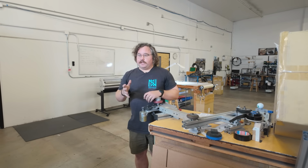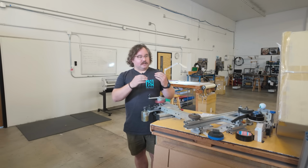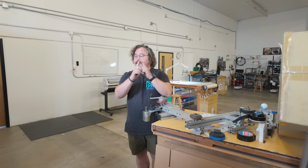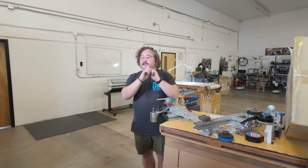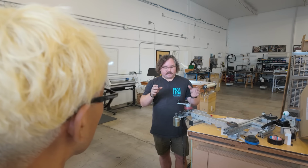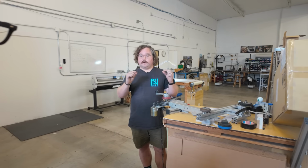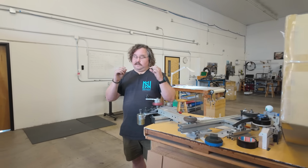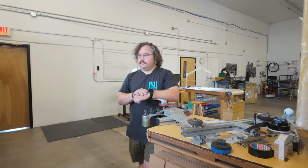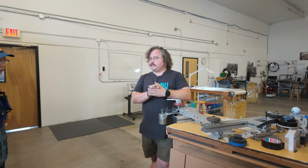Since we started as Rolf only, the paired spoke design, we wanted to make sure that the spokes would never pull through because there's a lot of force going to the same spot on the rim. So we have a thicker spoke bed that makes it so that you have a rim that's a little bit heavier, but also stronger and a lot easier to build up, I think, because of that thicker spoke bed. It was built out of necessity, basically.